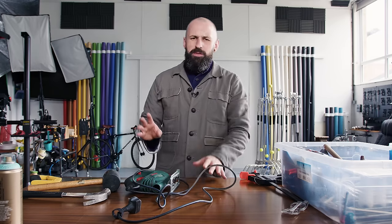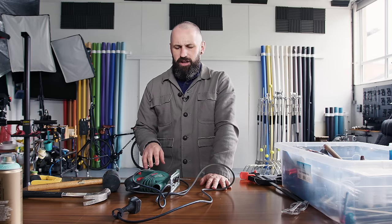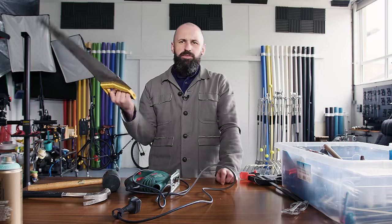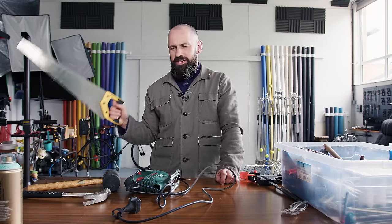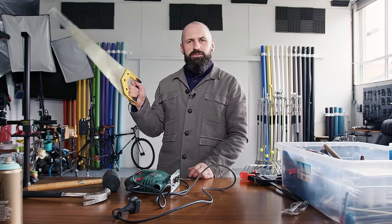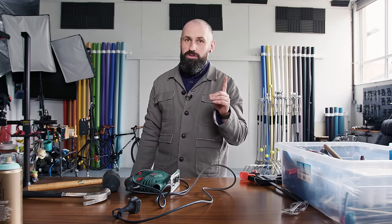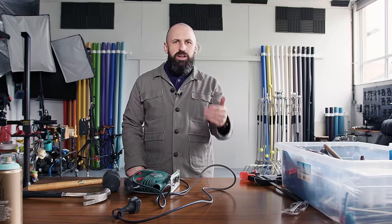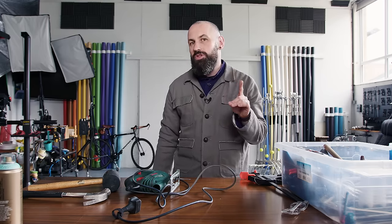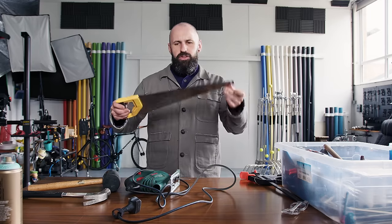Next up you're going to want to chop some wood. We have a circular saw here but it's currently gone back to my mate — that's what we normally use to cut big bits of wood. Often though, hand sawing is better, and the reason for this is the circular saw makes a lot of mess and we're in a studio. The hand saw makes less mess, so often we'll just hand saw something. It's rare that all sides of a set need to be perfectly cut — it's only where pieces come together, and often we'll use wood that's already been cut by the shop for those areas.